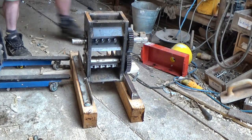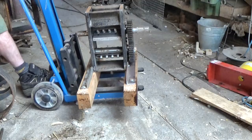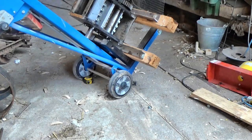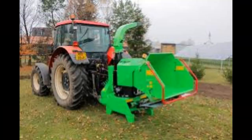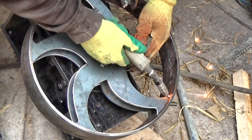I used coach bolts to attach it to some chunky timber and already it feels more solid. You may notice that it's upside down now — that's just because of the way I want to feed the branches in. It doesn't make any difference to the mechanism which way up it goes. Now of course this needs a lot of power to drive this thing round and round at high speed. Most people would use a tractor and it's all set up to connect to a tractor's PTO via one end of the shaft, but I don't have a tractor, so I made a pulley to go on the other end of the shaft.